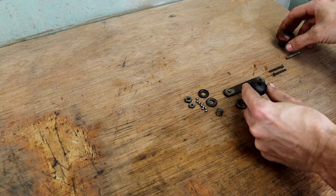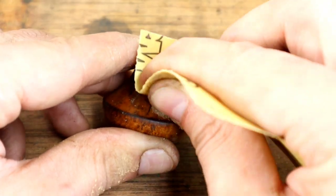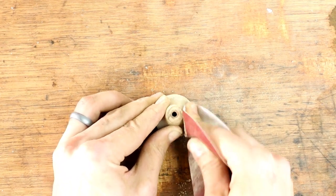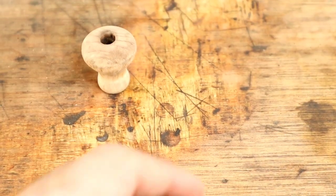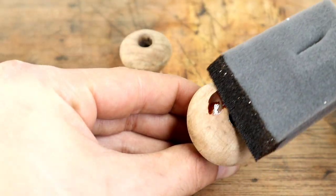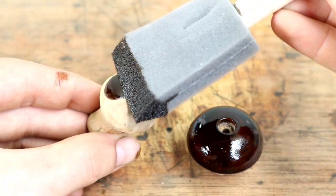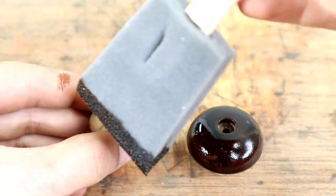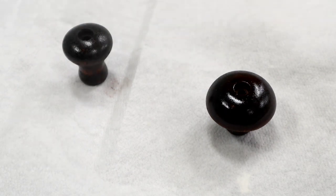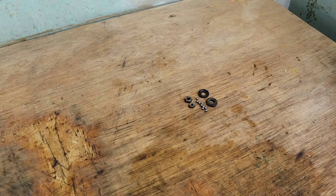For the two handles, I had to consider a few things. While they both probably started as the same color from the factory, the handle on the crank is now much darker from all the grease and oil, making it impossible to get out all the staining beneath the surface while keeping the integrity of the knob. To combat this, you can either make new handles and keep the original color, or use a darker stain to blend them in. Here at One Nation Restorations, we try to preserve as much of the original piece as possible, so we're keeping the two 90-year-old handles. After two coats of honey stain and four hours to dry, I gave them each two light coats of polyurethane top coat and let them sit for 24 hours.